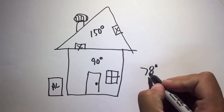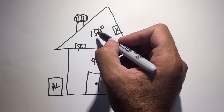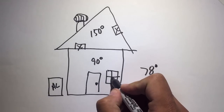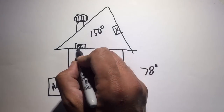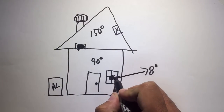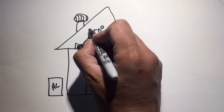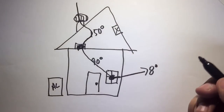Okay, let's say it's 78 degrees outside, 90 degrees in your house, and 150 degrees in your attic. If you open this window right here and turn on this house fan right here, it will suck this 78-degree air in through the window, throughout the house, and cool the attic venting outside.